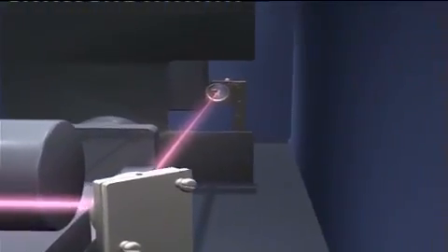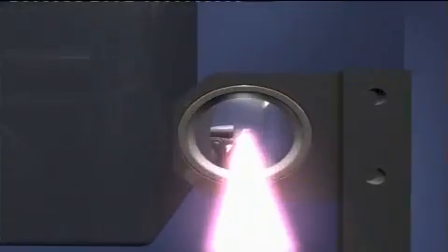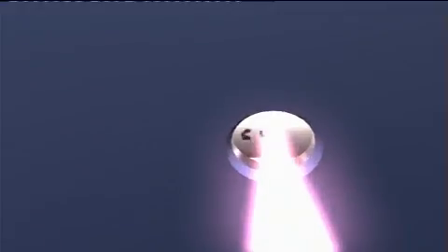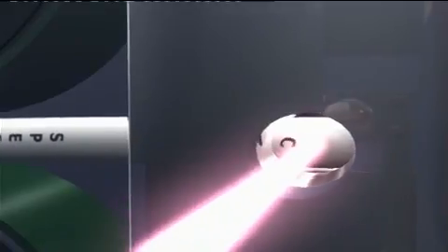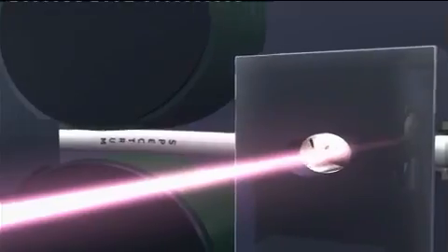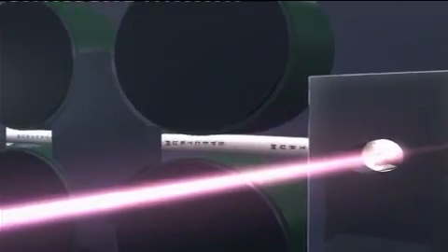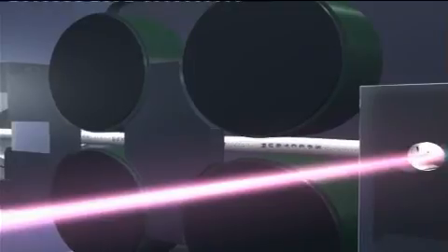After passing through the mask, the laser beam reflects off a single 90-degree mirror, through a fixed focal lens, and is directed onto the surface of the wire or cable to be marked. Ultraviolet laser wire marking is a cold soft kiss process — it does not burn into the surface of the wire or cable. The mark is generated through a photochemical reaction which is 100% permanent and is a mark for life.